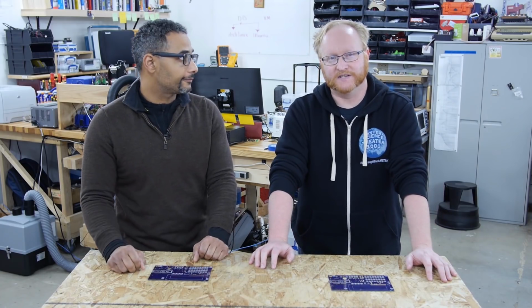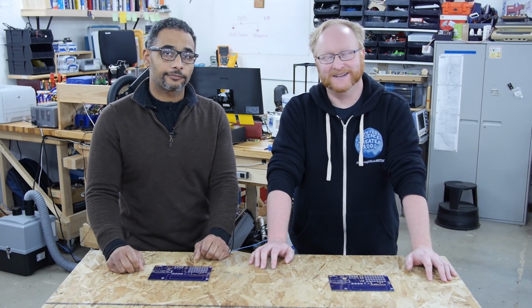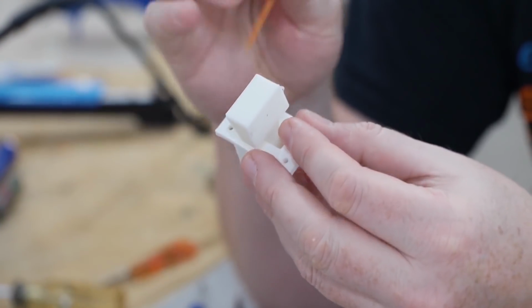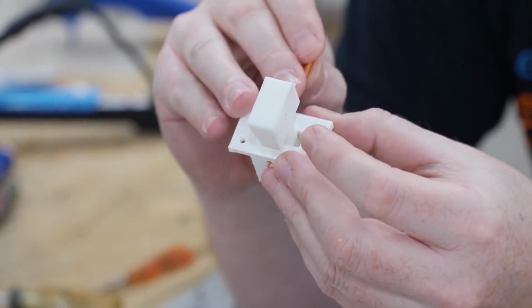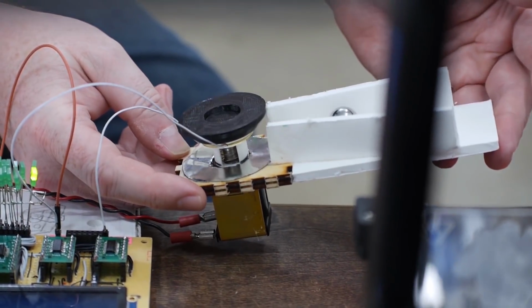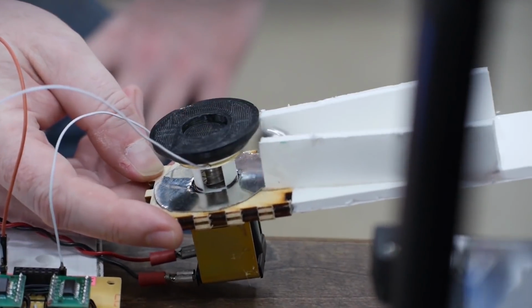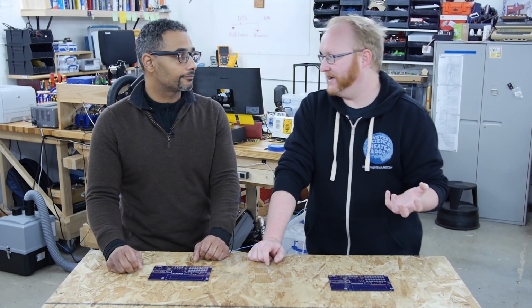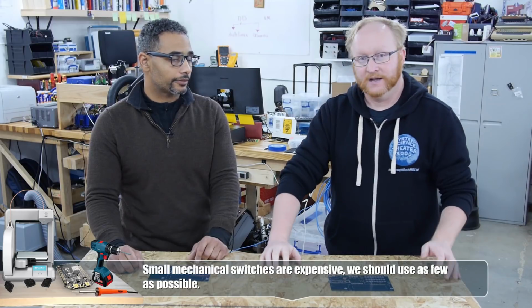Okay, I did design these boards pretty quickly, so they might not be perfect. So yeah, let us know how that goes. While you're working on that, I'm going to be doing some sensor work. Now, we've shown in previous episodes, we might have a target that gets hit and has a microswitch. We might have a pop bumper with a little ring around it that conducts electricity. But I was also thinking maybe a rollover switch that's infrared, like an emitter and detector, and the ball rolls over it and bounces IR light back down into the sensor, and it's like, oh, a ball. Yep, give me the signal back, okay.